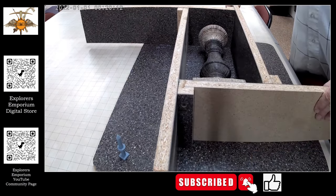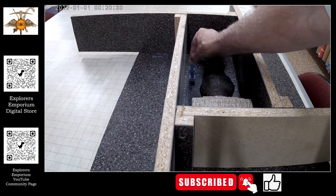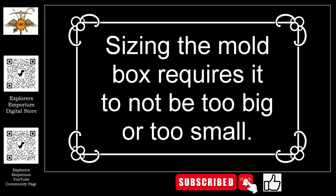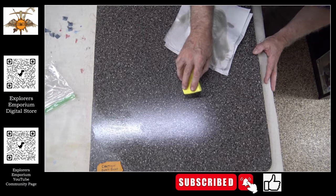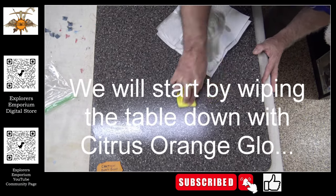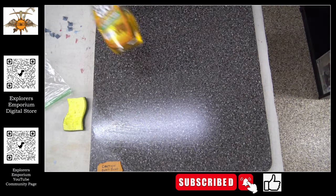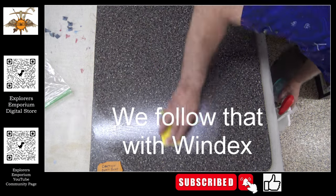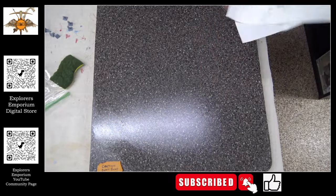Now we're going to give it a quick test and show you how all this works. This is a mold box where you can make different sized boxes in case you have to make different assorted size items. It's really important when you go to mold — silicone can be very expensive — so you want that mold to be big enough to hold the thing you are casting, as well as strong enough to actually hold the mold.